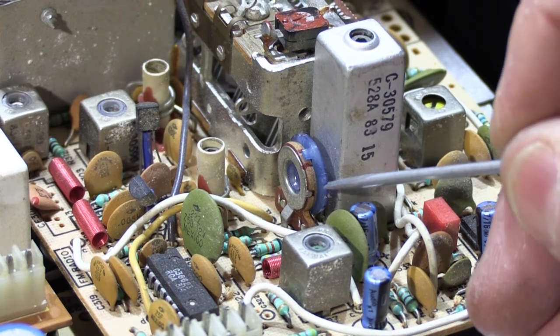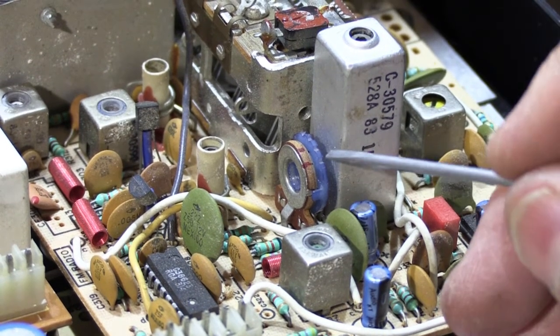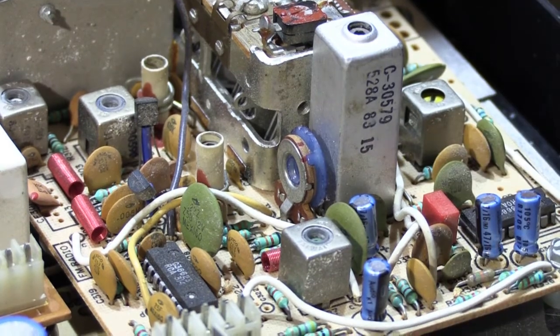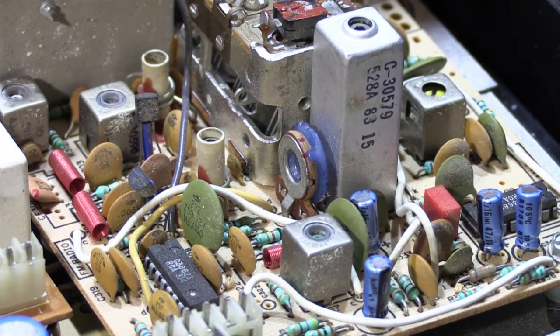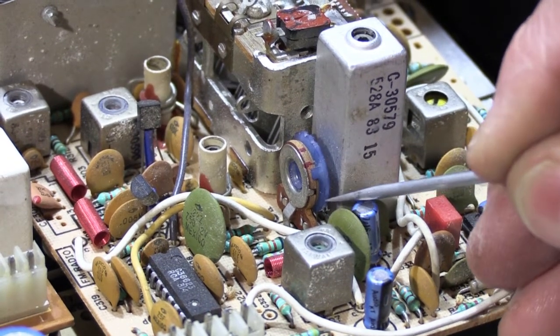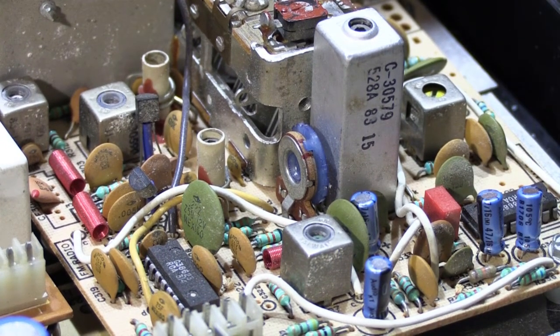If you find that yours is way too much squelch, which is not uncommon, way down here, roll it the other direction towards less squelch, and then tip the set up like this, turn it on, and try tuning in that station you're trying to receive and see if it works better. You can do this while it's playing. Most of the time, if you had way too much squelch, which tends to be the most common thing that I see, rolling it back to sort of a midpoint will oftentimes improve it a whole lot.